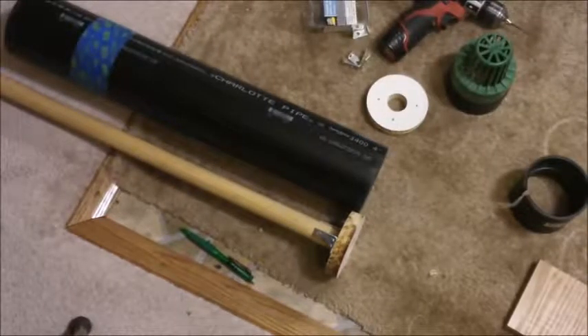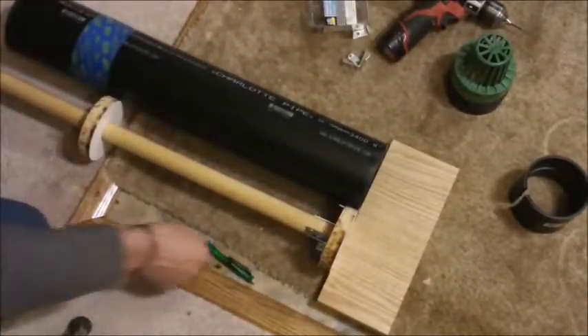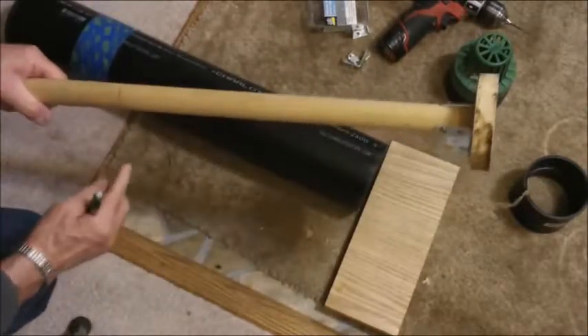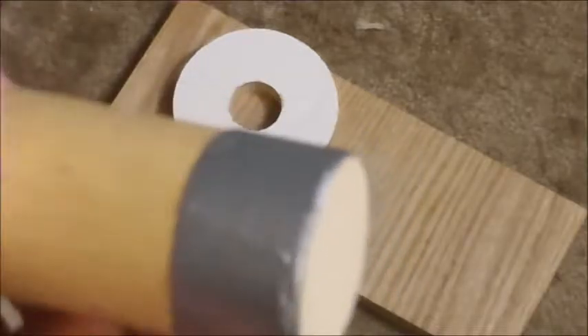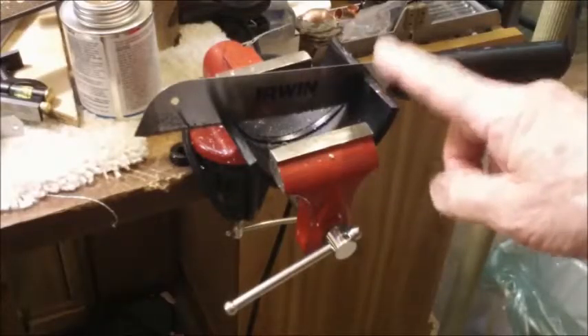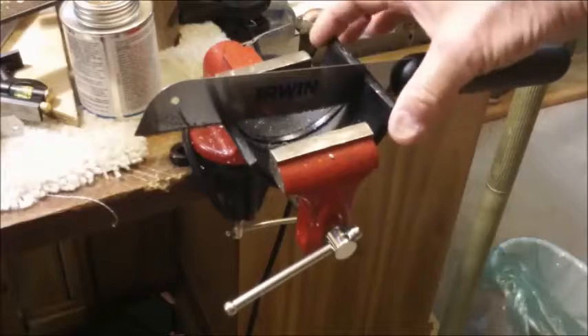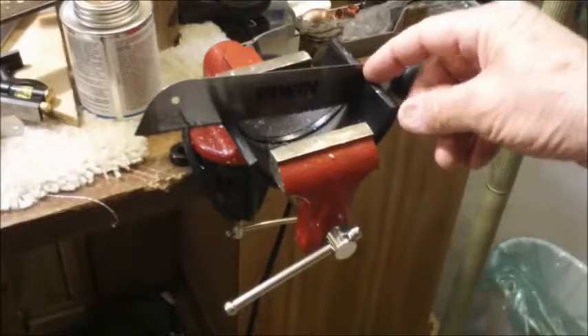So now I need to mark where to cut the dowel so that the other piece will fit on — just line up those two edges, then cut this off and fit this piece on right here. After cutting, I just wrapped a little bit of masking tape around here in order for this piece to fit in a little more firmly, and as you can see the platform is sitting there. Checking this with a T-square, that is very even all the way around. These were too difficult to mold to the inside circumference being four inches wide, so I decided to just go ahead and cut them in half — it will be much easier to do a two inch piece for the shelf to hold the filter.